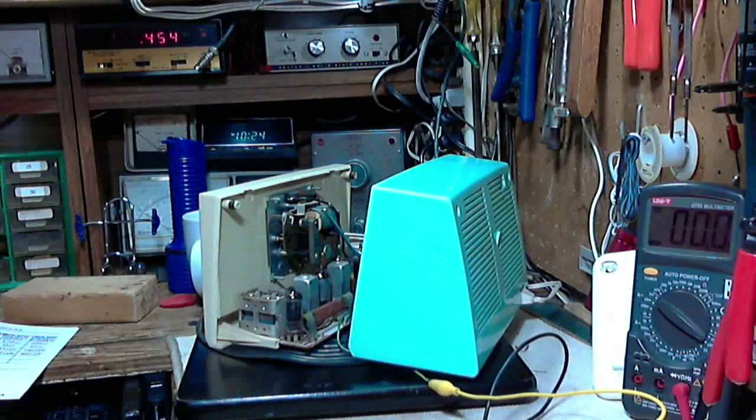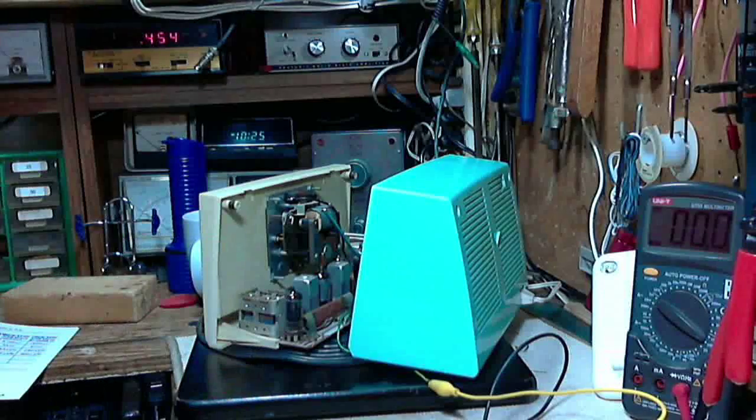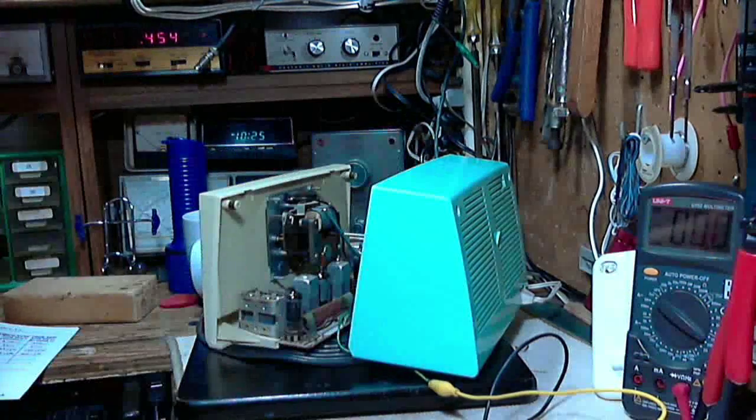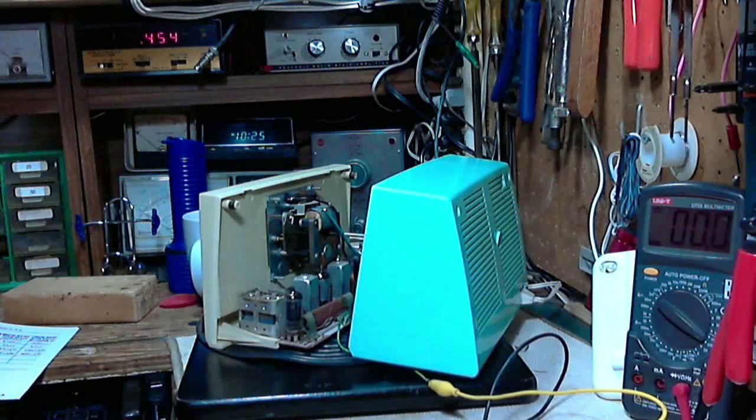That might be true when the radio was first built, but it's not true now. The radio is largely tuned, so this is just a tweakage of it. So hopefully we're going to be able to pump that 455 into the radio just feeding it through. A little bit of a rude way of doing this, but let's give it a go. So we need the radio on now.